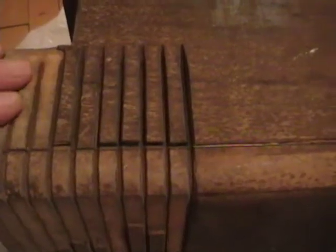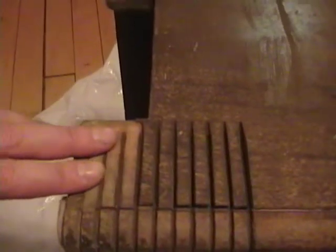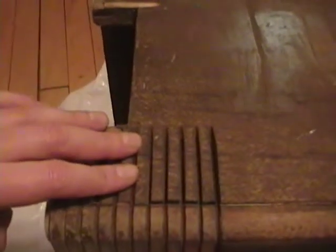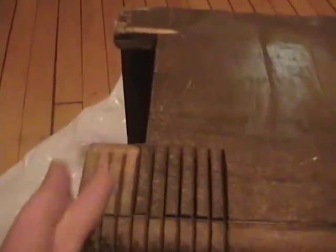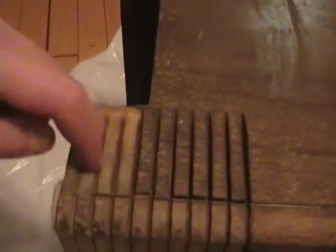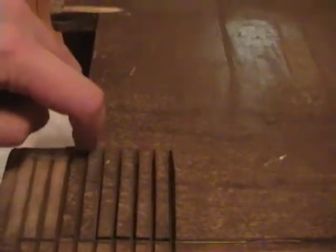Otherwise, I think I'll try to reproduce the way they made this originally. Here's the base wood — I believe it's plywood — then there was kind of an underlayment veneer, like some white wood, maybe birch or beech, and then the walnut on top. What they did was glue down just one continuous sheet, then used a saw to cut these notches in but didn't go all the way through — there was probably a rotary saw and they just stopped. These cuts gradually come out to full wood. I'll try to reproduce that as best I can.